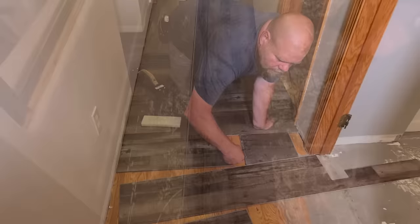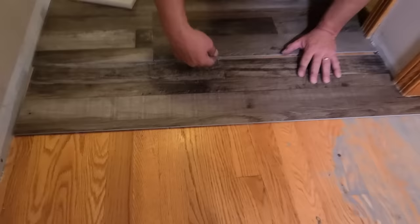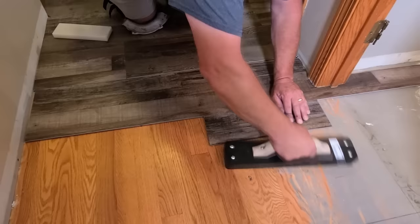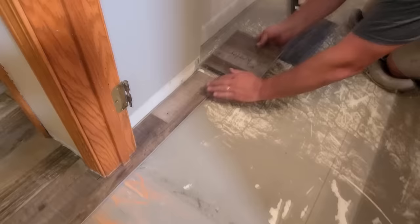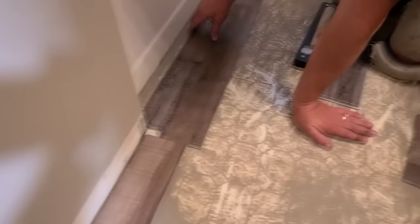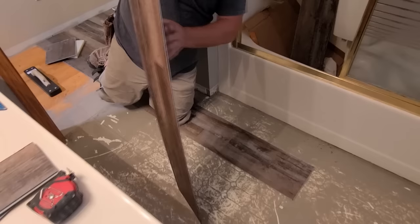I went outside and cut this piece and I'm going to take these pieces out. I'm working backwards in this hall right now — meaning the tongue is right here, so I'm putting the groove into the tongue instead of the other way around. It makes it a little more challenging but not too bad. I'm just going to get this piece in place — I have a pretty big gap there, I think I want to go that way a smidge. Actually I'm not going to put this piece in yet — I'm going to put it off to the side until later. Now I'm going to reverse it again so the locking systems are reversed: here's the tongue, here's the groove. Slide this all the way to the wall and make my mark.